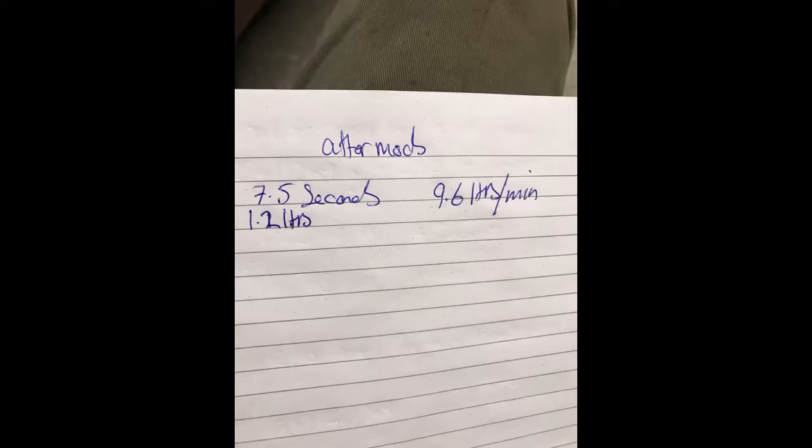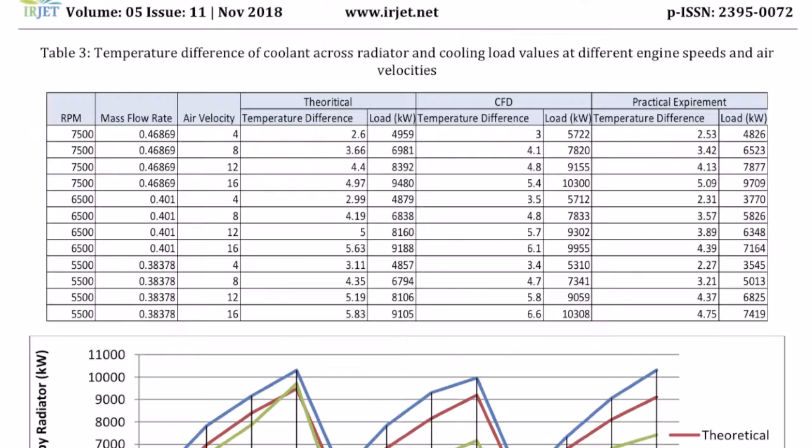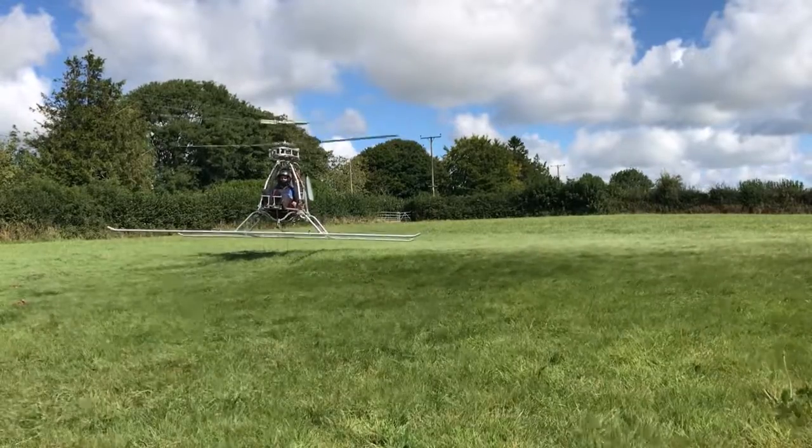It's an improvement but not enough in my opinion. From a bit of research on a similar engine, a flow rate for adequate cooling was 23 litres per minute at 6000 rpm. It seems a temperature drop across the radiator at 6000 rpm should be around 4 degrees. I ran the engine at idle and measured the temperature drop which was 4 degrees, and it maintained an engine temperature of 52 degrees only on idle. In the next test I will see if the maximum flight time of 1 minute 30 seconds has been improved.